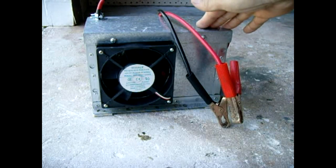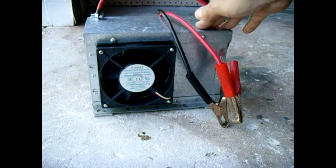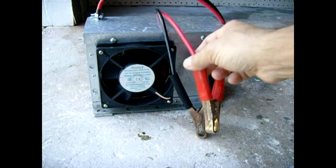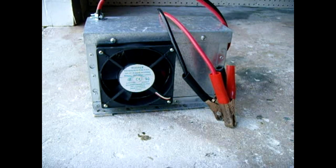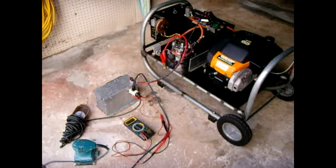I'm going to demonstrate using my 12 volt marine battery on my inverter generator. I have a 100 watt light bulb connected as well as a palm sander, and I'll run both together. When the connection is first made, the fan will come on, you'll hear the transformer humming, the power indicator will be on, and the light will come on. After about half a second to one second, you'll see the light come on even brighter — that's when the inrush resistor has been bypassed. The negative from the inverter is now connected to the 12 volt battery.